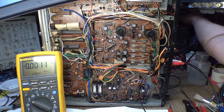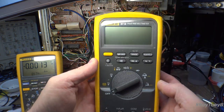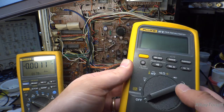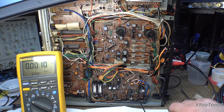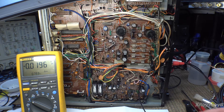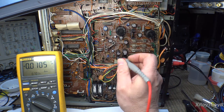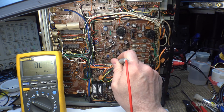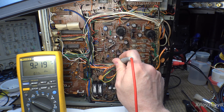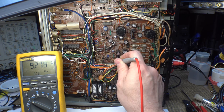I have an 87 here and, just like I thought, these do not have the AC and DC dual display capability. A lot of lower-cost Chinese meters actually have this option. Anyway, this purple wire should be 13.8 volts DC — and since we're on the dim bulb it'll be substantially less, but it should be a clean DC signal. And it is: you can see 9 volts with barely millivolts of ripple. That's what we want.